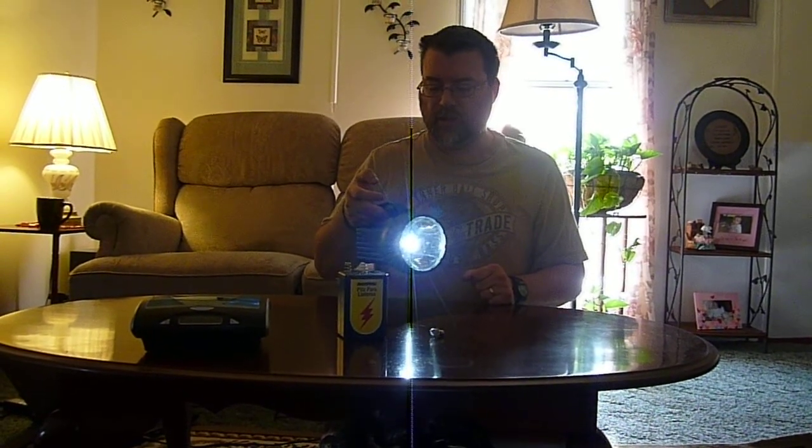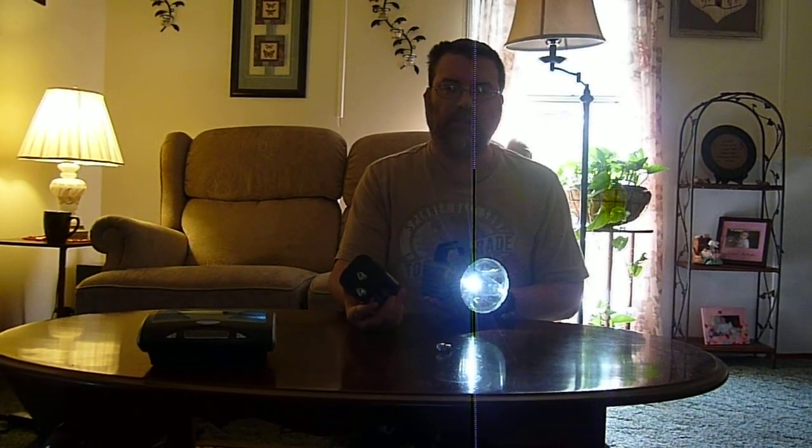And now we've got a super bright LED rechargeable flashlight that will last hundreds of hours longer than the old combination and is easily rechargeable. We have an example of a recharger that will take triple A's, double A's, C's, and D's, and nine volt rechargeable nickel-metal hydride and or nickel cadmium batteries. One of the neat things about this is it also has a USB port on the back so that you can also charge your USB devices like a Kindle or a cell phone or an MP3 player. The batteries will charge first, and then once the batteries are charged, the device plugged into the USB port will start charging. This device has a 12 volt input and comes with a one and a half amp adapter, so this can easily be charged in the vehicle or you could even plug it into a solar panel and charge the batteries with solar.